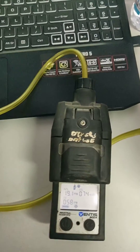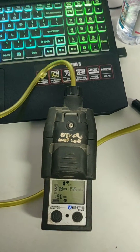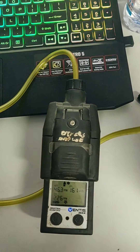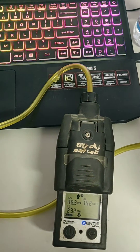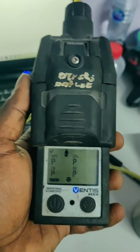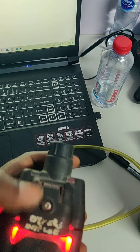The multi-gas has been applied. The sensor is detecting the gases and will automatically adjust the span. We need to wait for the span calibration — it will take one to two minutes. The span calibration has now finished. This completes the calibration of the Industrial Scientific Ventis MX4.